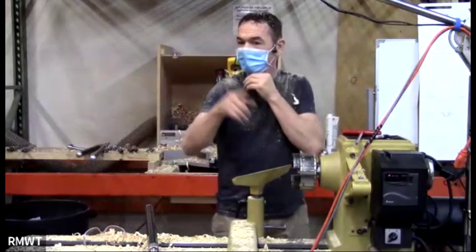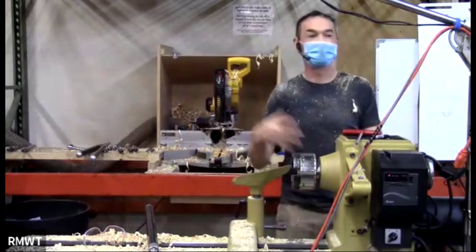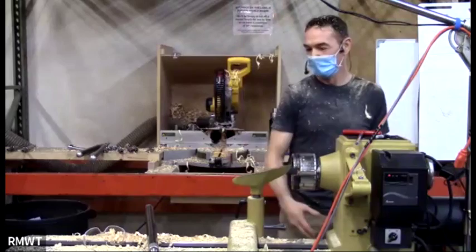And it's just that if I took that off, it takes 5 minutes. You got to flip the headstock upside down, clean it off, clean it. Then you got to put it back without getting more dust on it. Because just in the 5 minutes you took it off and put it back, some dust in the air, especially if you used an air hose, it's back on the bed. So keep that in mind about moving headstocks.